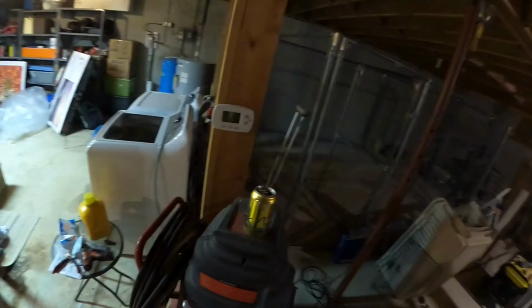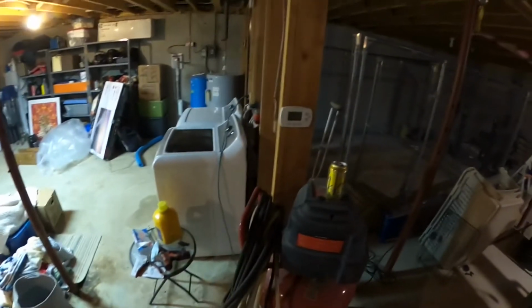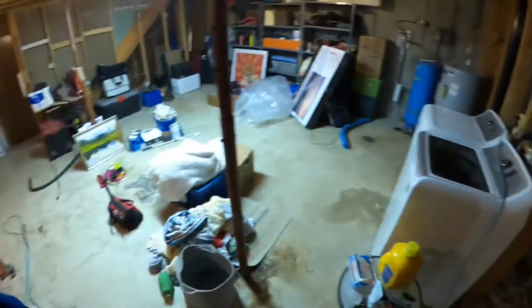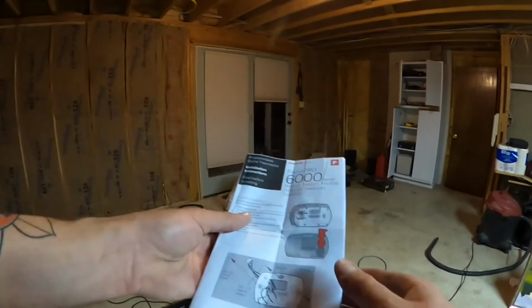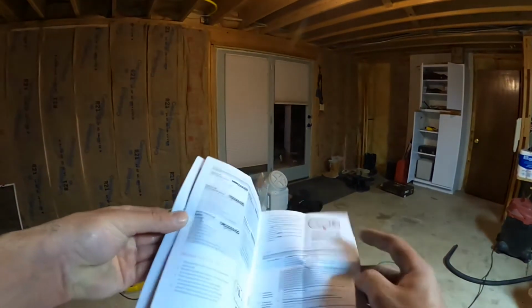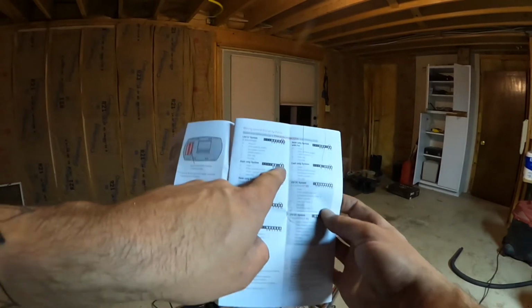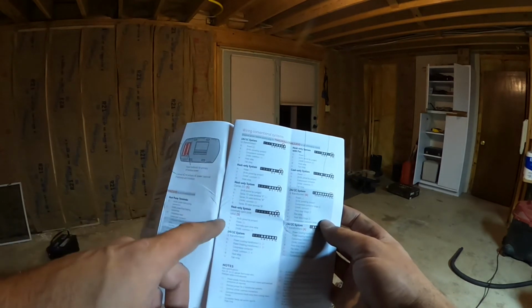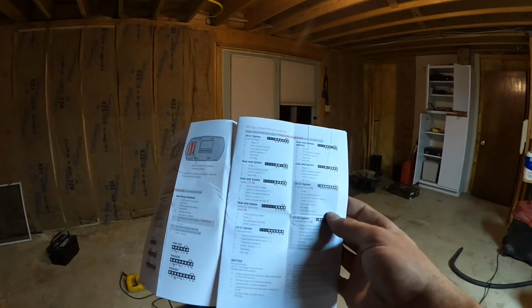When it comes to the thermostat, it's a 2-wire system because it just hooks to a single control valve. It doesn't have a fan or anything else. This particular thermostat is a Focus Pro. So I just looked in here to hook it up. I removed this jumper. It had a jumper on it. I removed the jumper and I hooked it to W and R for heat only. And I didn't have any power going to it, so I'm just running it off a battery.